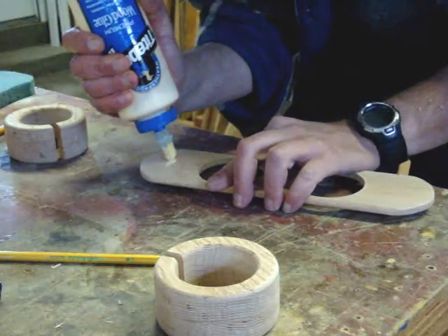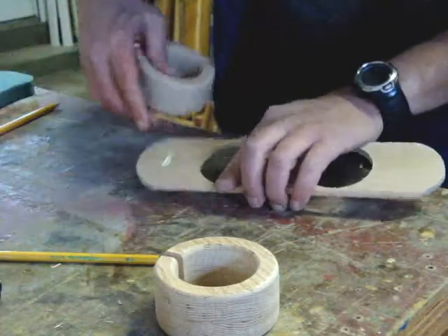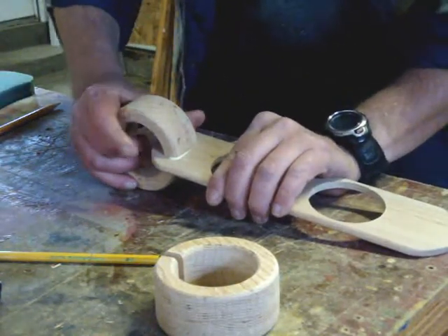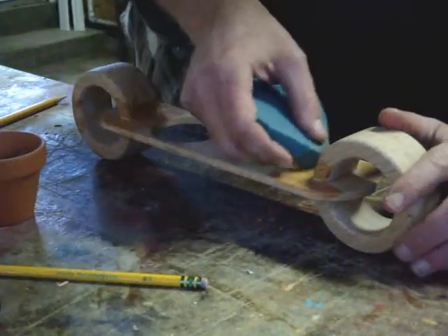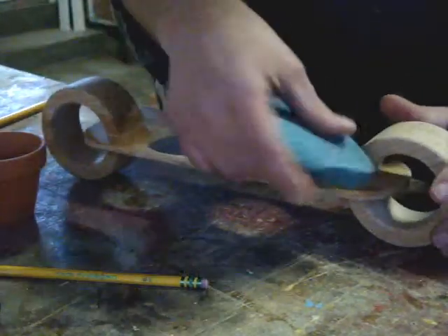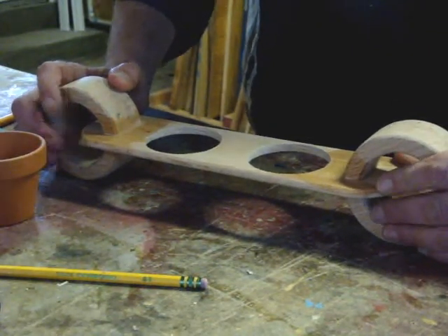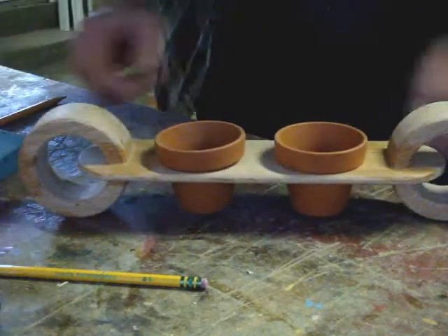To glue this up, I can't figure out any way to do it other than it's just going to get messy and I'll have to clean off the glue. So what I've done is put a little dab of glue there and now I'm going to slide this on just like that. It really doesn't need a lot of glue to hold it. Just try to get it centered about where I want it. Now I'm just taking a wet sponge and wiping off the little excess of glue. I don't think I really need to clamp this up because these circles fit tight enough that it's going to hold on its own. I just want to make sure everything is aligned correctly — eyeballing it and making sure it looks about equal on both sides.